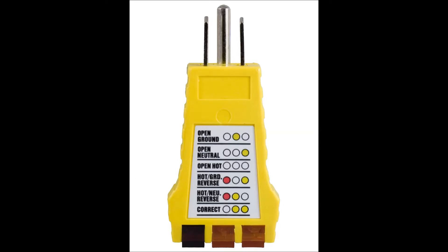I mentioned our dangerous electrician was using a tester much like this one, and this type of tester is very popular among campers as well, trying to protect from the above conditions. However, neither understands its limitations. If you were to smash one open, you would find that it is literally a triangle of light bulbs between the pairs of prongs, and only indicates where there is power and where there is not. Never underestimate a determined idiot — with enough mistakes, the most dangerous condition matches the ideal condition.